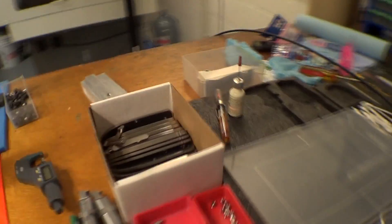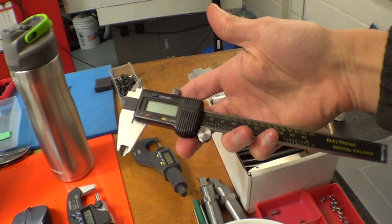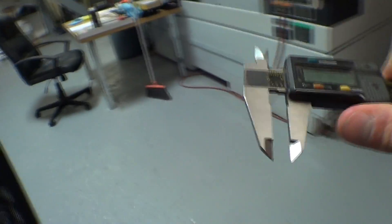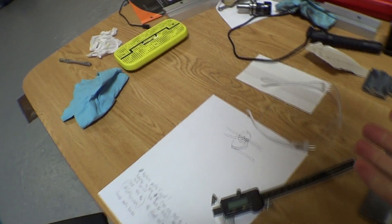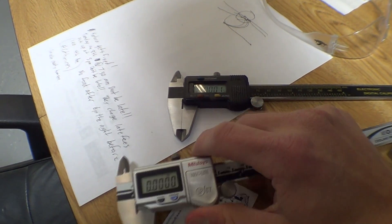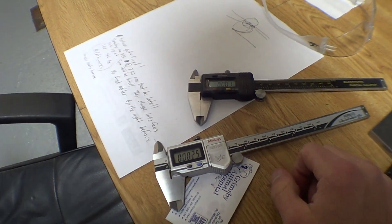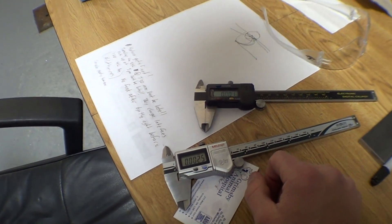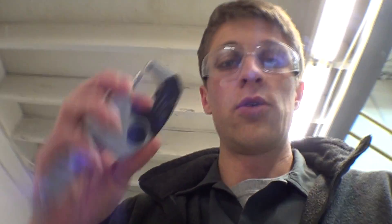If you're on a budget, don't overthink it — $45 and the precision is there. Same with calipers: I've had a Harbor Freight electronic caliper set for $20 for ten years, they go through batteries faster but they work great. We also recently got Mitutoyo coolant-proof calipers — sturdier, stronger, more precise rigidity-wise. In my eyes the calipers are a rough estimate tool and the mic is the accurate tool. I'll use the Mitutoyo mic here since I paid a lot for it.